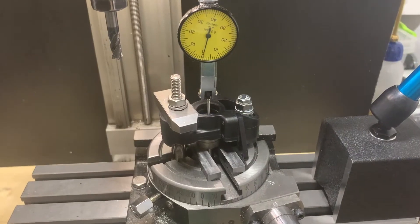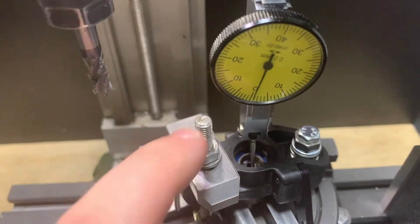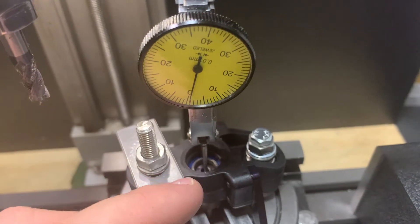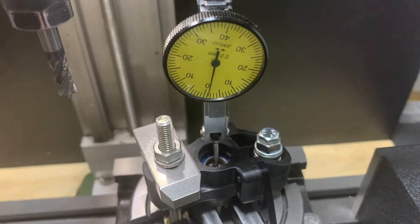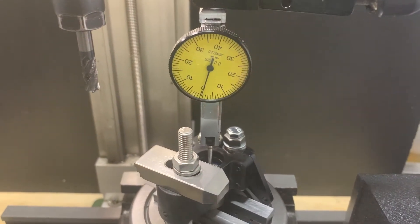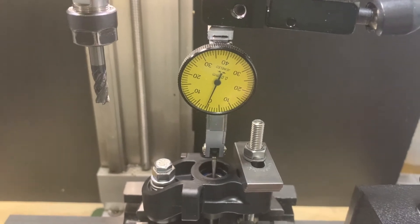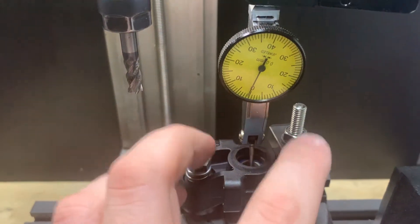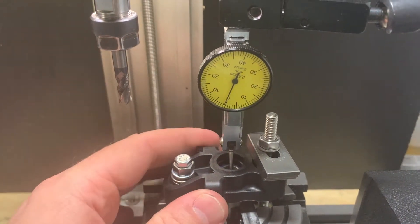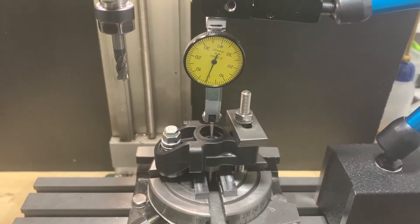For mounting the front hubs, I'm using a shaft inside the bearings — an 8mm shaft piece — and using a bearing as a base, because the plastic part is not accurate enough to use as a base directly. I have about two thousandths of play, which is more than enough for this kind of part. When mounting it, the dimension is already changing slightly because this plastic is very soft. Now cutting in absolutely the same way as with the rear hubs.